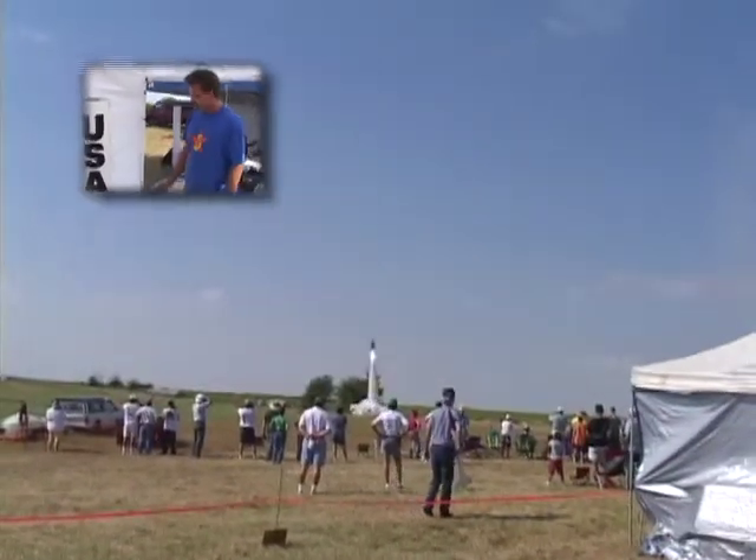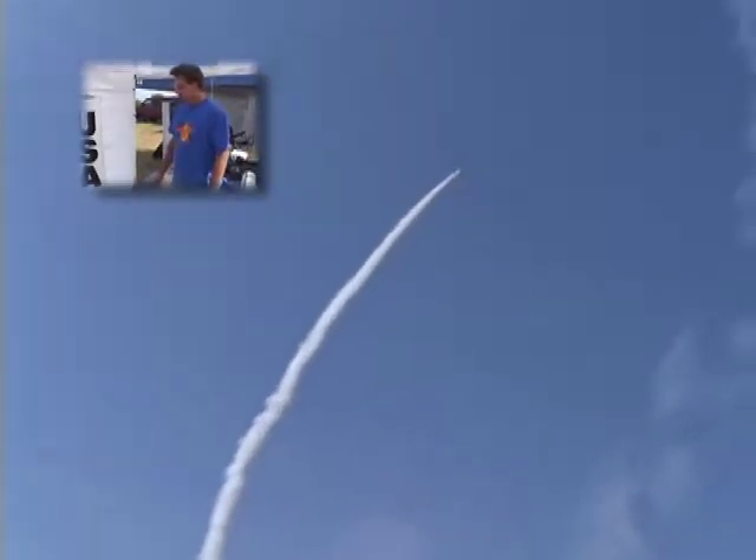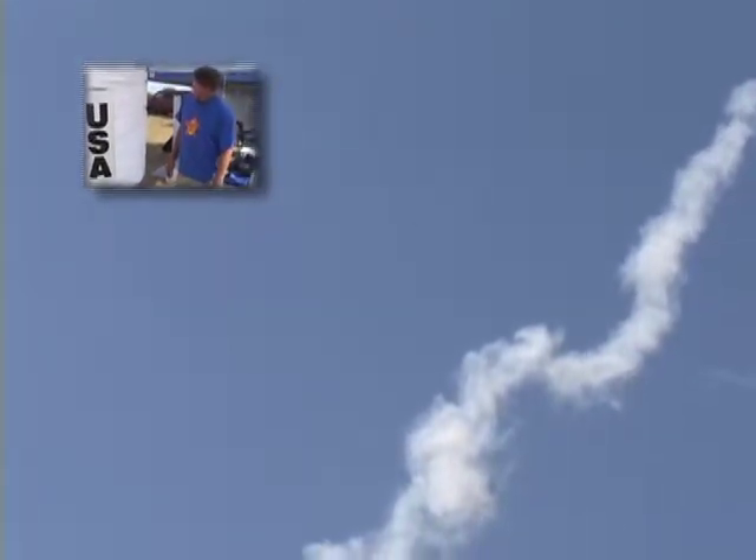For something this size, the fins are usually a problem in trying to keep weight down. On this particular fin, there was a 1-inch blue board — which is typically used for insulation on the sides of homes — with layers of fiberglass overlaid in different angles and then pressed together. All the excess resin and air bubbles are squeezed out of it. It's more or less pressure laminated. What you come up with is a hollow core fin that weighs about a pound and a half.